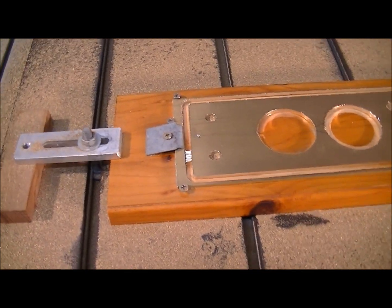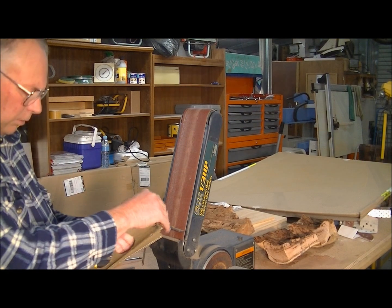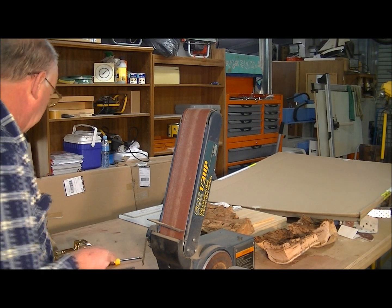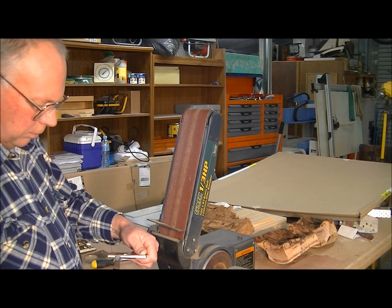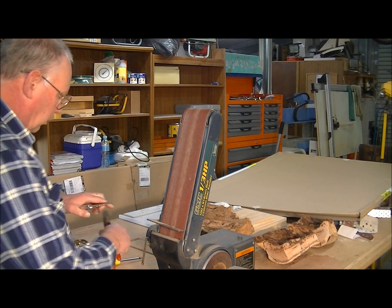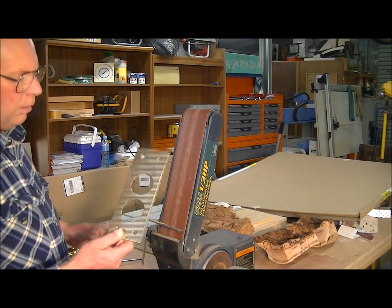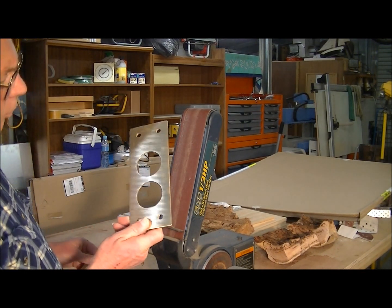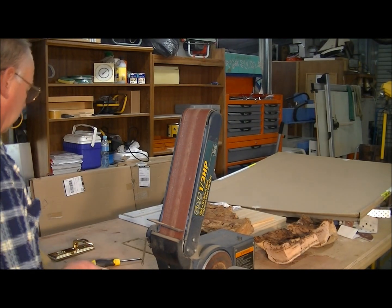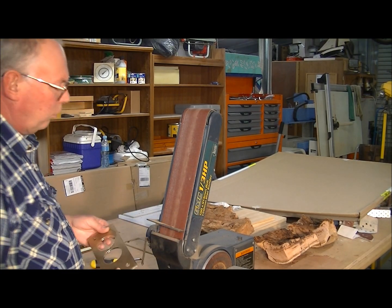So we shall take it off here now. Break off the little tags and then put it on my sander and see the end result. I can cut a piece of work off the bed, just break the tabs — you can pull a lot of it off with just a pair of pliers like so. Of course these are very sharp; they're like razor blades. And just a little tip: this is the first one I did. If you notice the brushed metal look — well this is how they do it. I'll show you the whole process of getting all the burrs off and getting that brushed look.